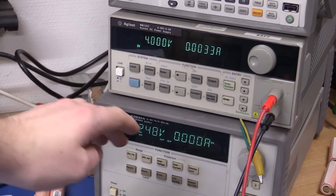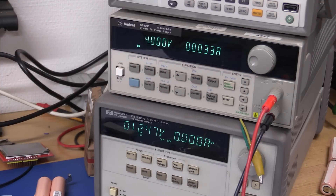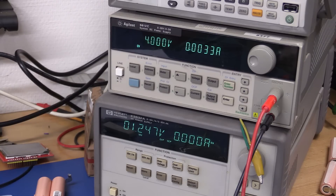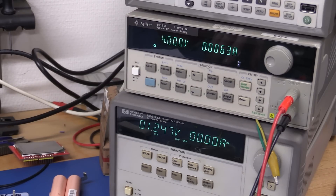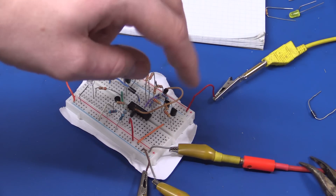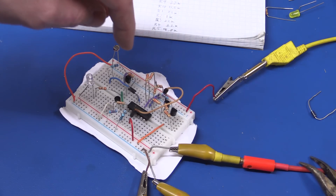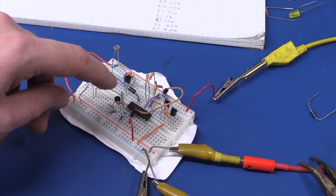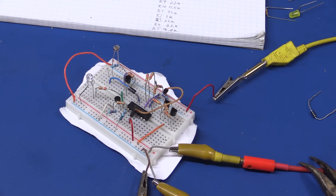Powered from 4 volts with the LED off, the circuit uses 3.3 milliamps - acceptable. The 1.25 volt reference uses basically 0 milliamps. The circuitry is divided into sections: charging and solar panel control, light detection and LED switching, and low battery voltage monitoring to turn off the LED when too low. When I cover the LDR, it does light up.